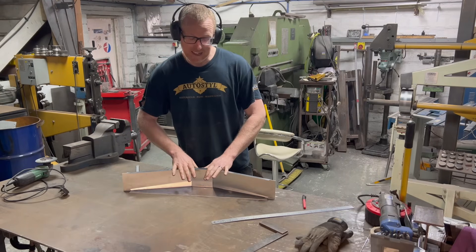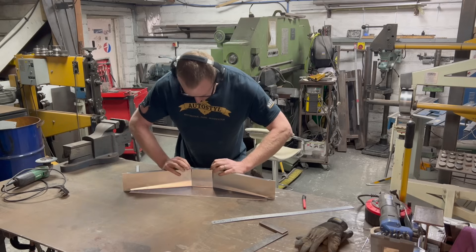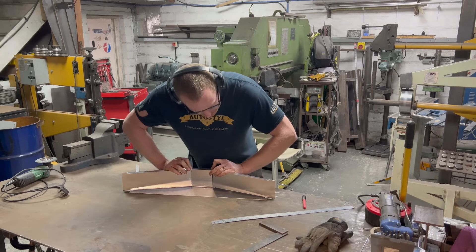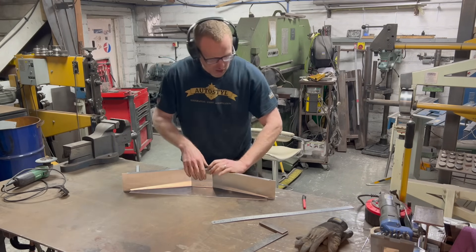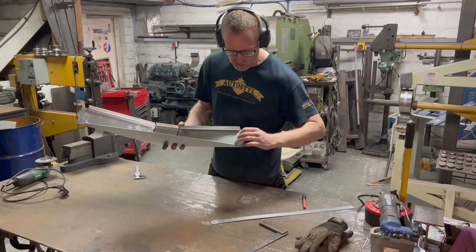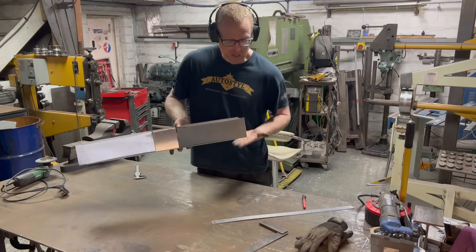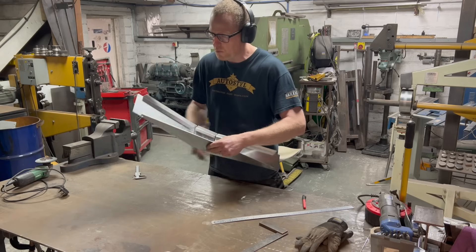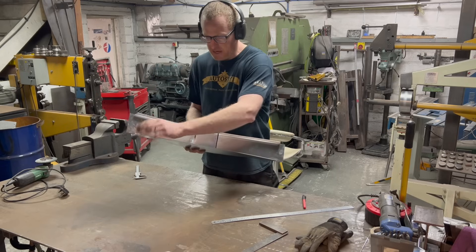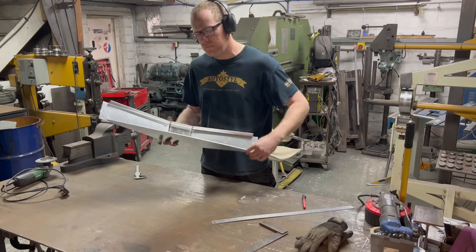It's not bad — not perfect, but not bad. The folds I've done are absolutely spot on, I'm really happy with them. The tops line up and the gap is weldable, which is what I wanted. The issue I've got now is I'm going to struggle to fold this one back with this piece already in place, because I've got to butt it up to the lifting part of the folder — same on this side. And then I've got to work out how to bend that lip down. I probably should have bent that one down right at the beginning.